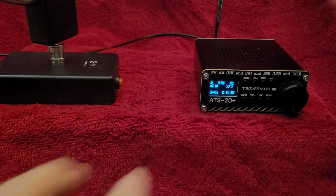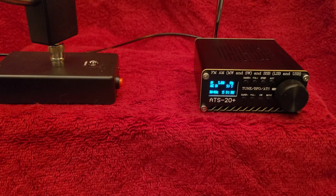The other thing that I noticed that I didn't show you is that on the medium wave band using the telescopic antenna, I didn't receive a lot of stations. Normally I receive a lot of stations. FM was fine, but on AM I didn't receive many stations. And I'm thinking the reason is that on medium wave, you typically want a ferrite rod coil antenna, which this doesn't have. There's nothing inside, I don't think. I'm pretty sure. I've seen the inside. I didn't take this apart, but I've seen it inside on Fred in the Shed videos. So it's really struggling on medium wave.